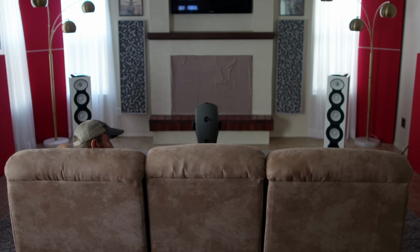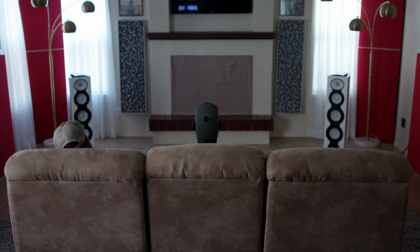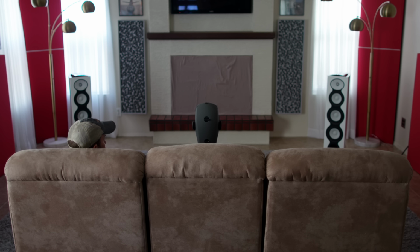Not bright loudspeakers. I can tell you that right now. They're very balanced throughout the upper mid-range. Normally that brass section that we're listening to, it can be a bit shouty. It can be a bit much on some loudspeakers, especially if there is a problem in upper mid-range. And often that's where you're going to see a problem. We either don't have a great phase relationship from the woofer to the tweeter, or maybe we have breakup modes of the woofer that haven't been addressed in the crossover, and this typically leads to stored energy and stuff that sounds yikes. And with these, no, it sounds fine.